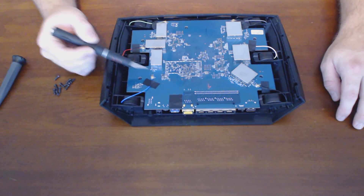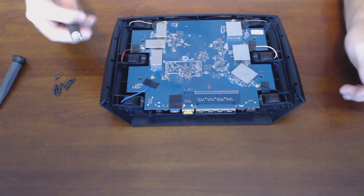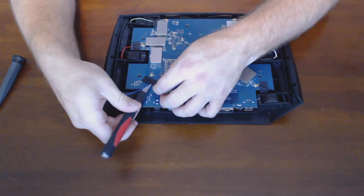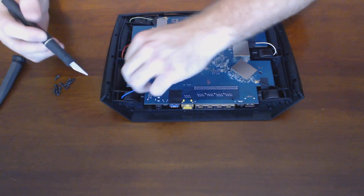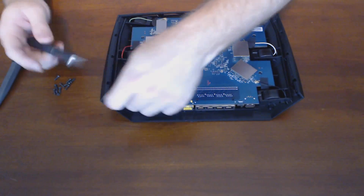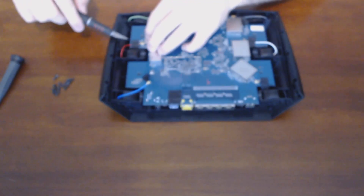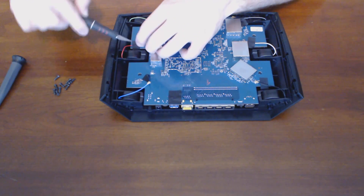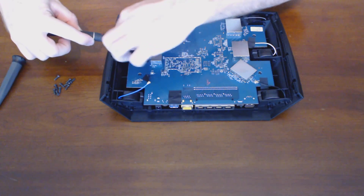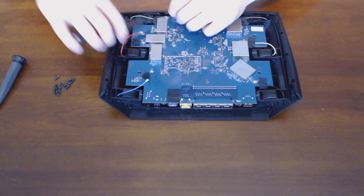You can see that they use antennas that are soldered directly to the board. So all you need to do to get the board out is lift the black tape up off of each one of the antenna pigtails and pop the pigtails off the board. It works relatively easily. I'm going to go through and take all these off real quick and show you what the other side of the board looks like.